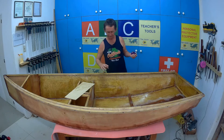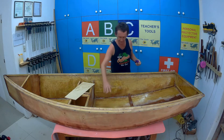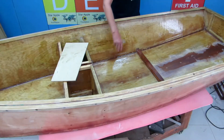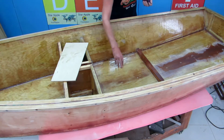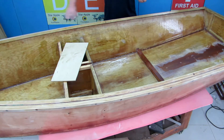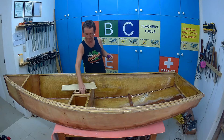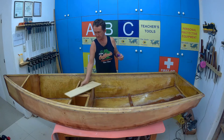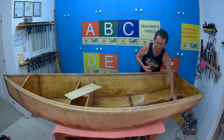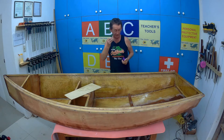It's been a few days since I did some recording. In between time we put in one layer of fiberglass — six ounce, 200 gram — because if somebody's rowing here it makes it a little bit stronger. We filled in all this; the boat has got two coats. Our dagger board case is finished — a little bit of work to do on the very bottom when we turn it over. This needs to be sanded just once more. Our next job is to put in the buoyancy tanks in the back.